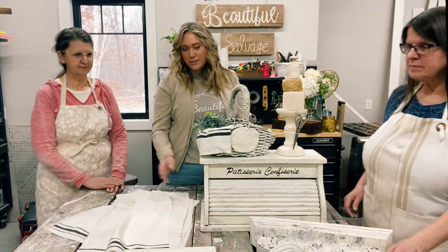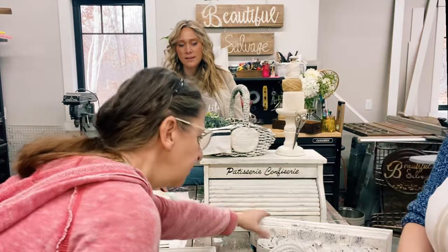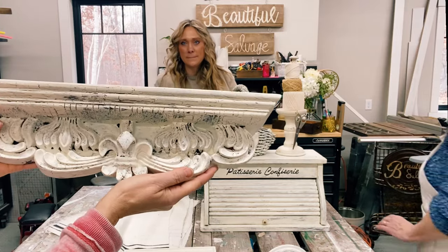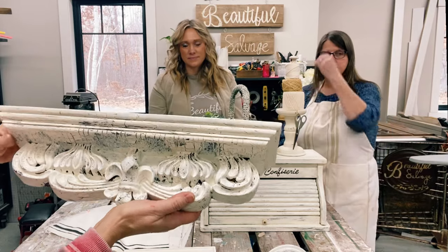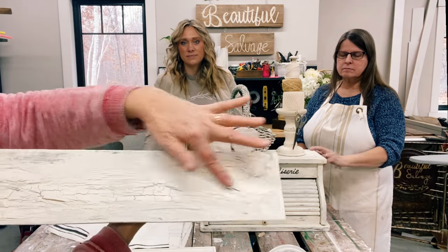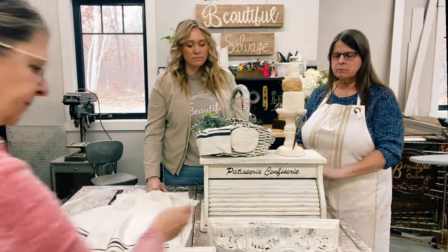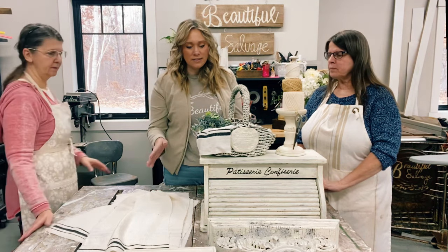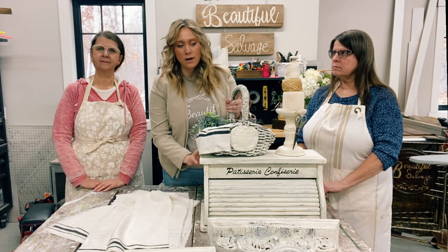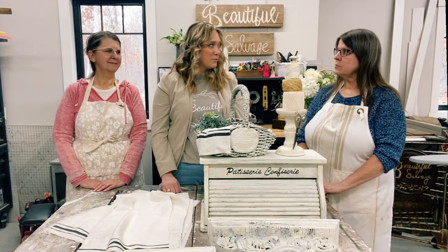And then Julie did most of the corbels. They turned out pretty well. We put the coating of glue on first, let it dry a little bit, then put on the paint — the same paint as the rest of it — and then used the heat gun to dry it, and it gives this beautiful crackly look. And then I waxed it. So everything that you see today — the basket we didn't wax, but everything else we used a clear Waverly wax on. Very fun projects, very beautiful.